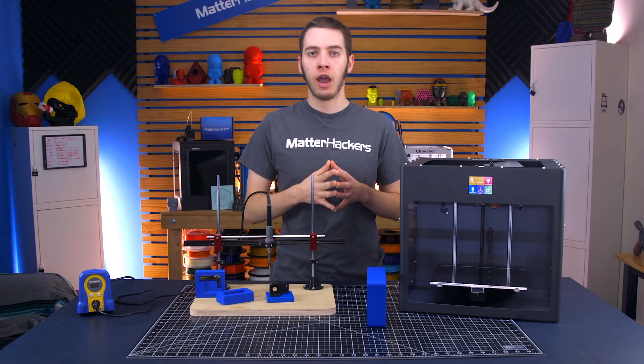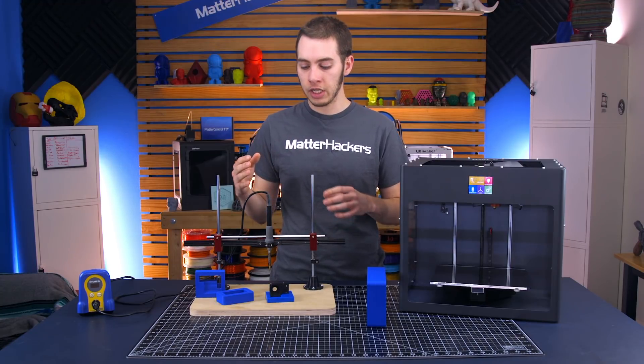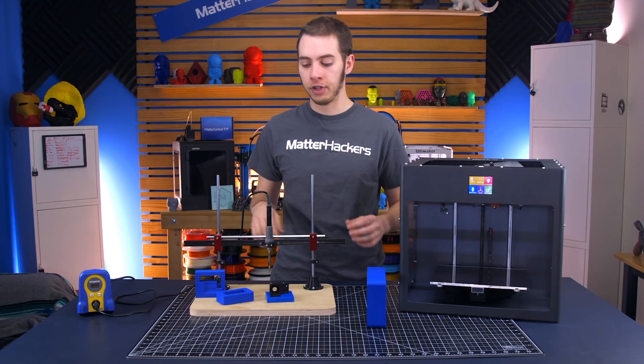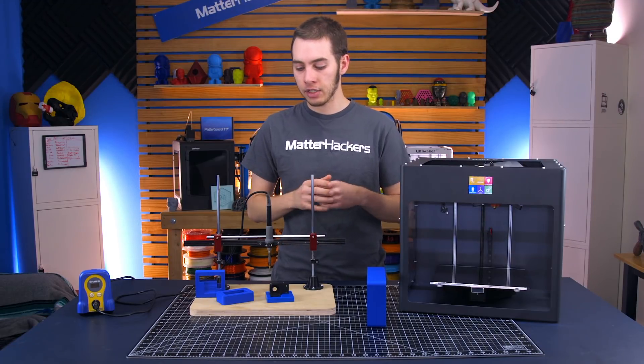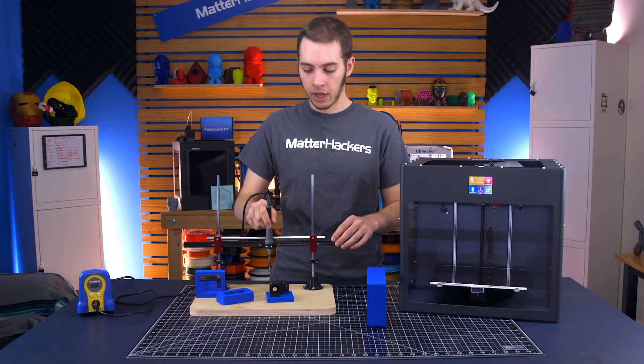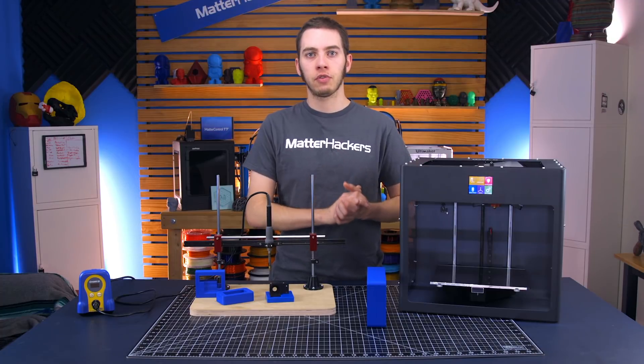You can do the same with the case for the electronics — that's what this piece is for. We have a couple other pieces here that have heat set inserts, and this fixture will just make sure that every single time you plunge this, everything remains at the exact same surface. Fixtures are really handy for having repeatable results for parts you intend to do a lot of — not something basic like just drilling a hole through, but something more specific like inserting heat sets or pressing nuts in to the same depth. That's where you'd use a fixture.